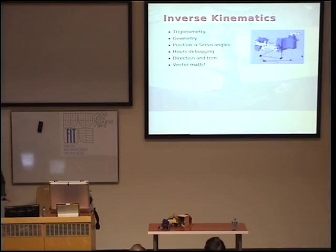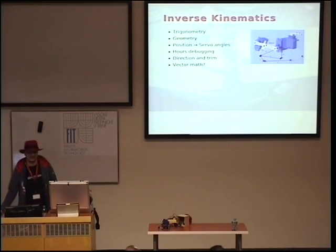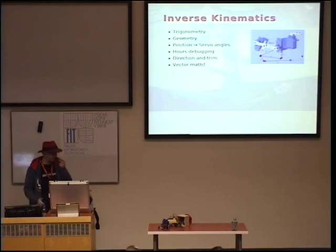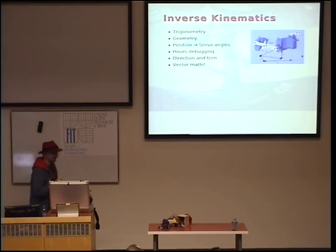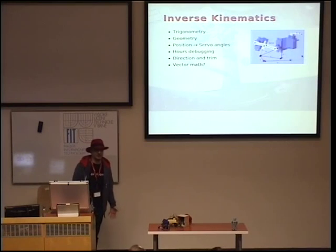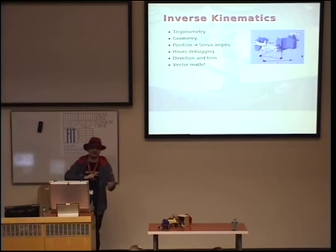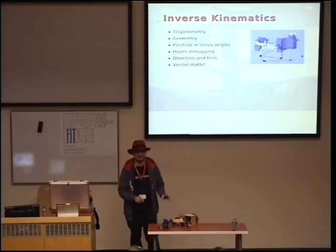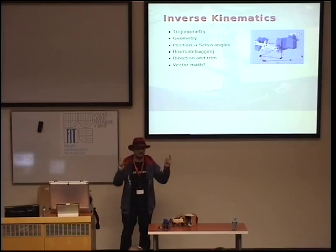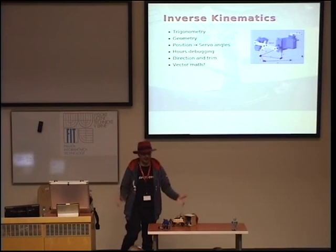Okay. So to move the leg to an arbitrary position, you actually have to do some calculations. And fortunately, for just 3 degrees of freedom, you can do that with simple trigonometry. Unfortunately, with any physical object that you are programming, it's actually hours of debugging, and it always does the opposite thing. And with this guy, I replaced the servos at some point, and it turned out the new servos were rotating in the opposite directions than the old ones, and it literally tore its legs off.